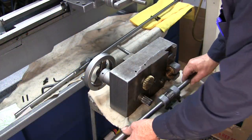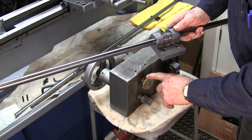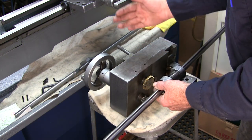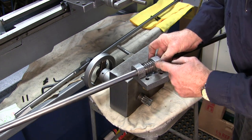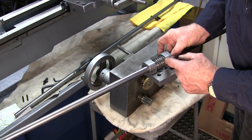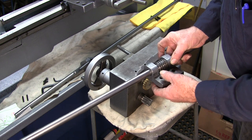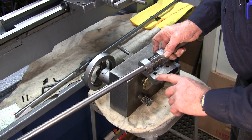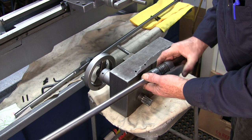All right. Okay, the first thing we're gonna do is, this is the worm gear that drives this for your feeds. Okay, your general purpose feeding, facing, and all of that. Now, remember we built up and put that bushing or that thrust washer in here, bronze, silver soldered in. There's no more play in here, or very, very minimum play there. And now this surface here is rough machined, and then they ground it and hand fit it to where it fits in there.